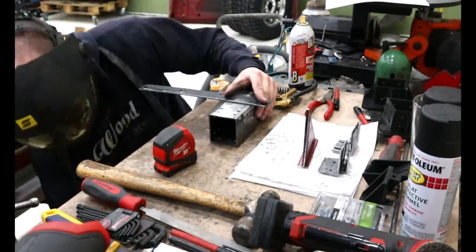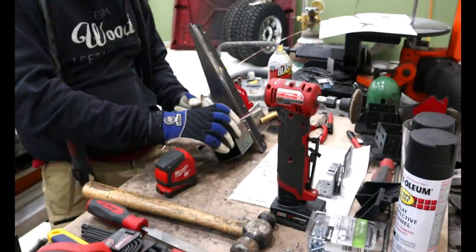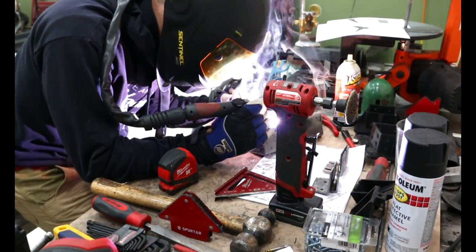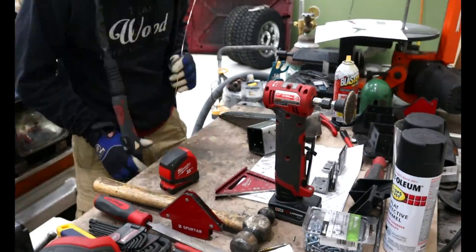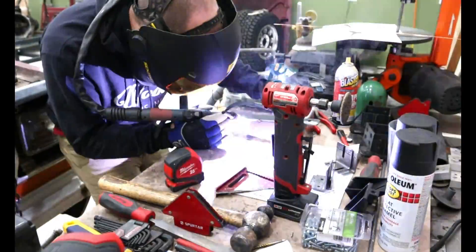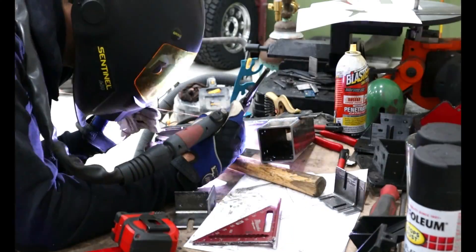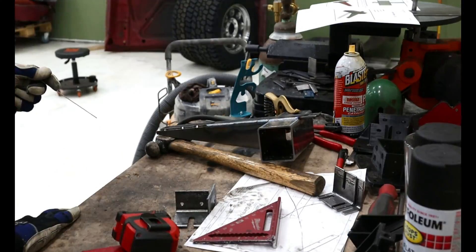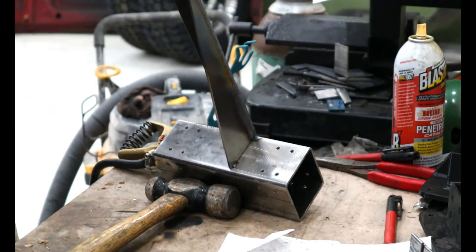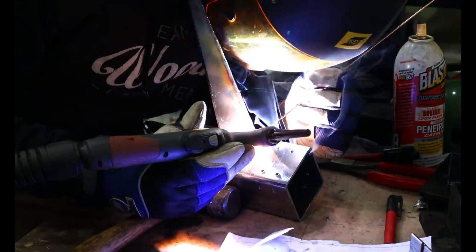Three: there is room for improvement. Firstly, the gantry X-axis would have been better if it was supported on both sides. I've seen a lot of people add a caster wheel which rides along the table frame to do this, and in the future I will probably do something similar. Secondly, although this may add some expense, this would be made easier with extruded aluminum and appropriate hardware, similar to how some 3D printers are. Thirdly, some of the brackets they have you fabricate I ended up just modeling in CAD and 3D printing. So far they seem stout enough for the job, but now that the machine is up and running, I may end up cutting these out of steel if I see the need.